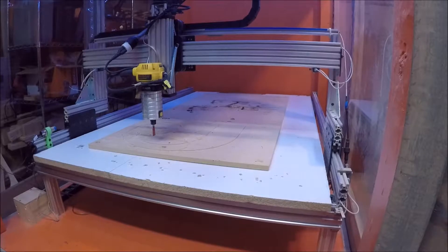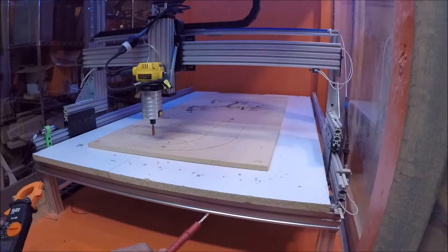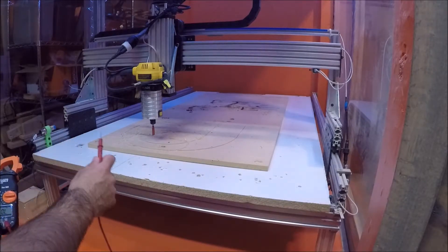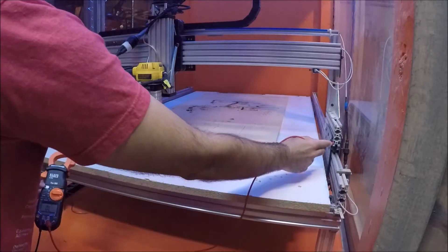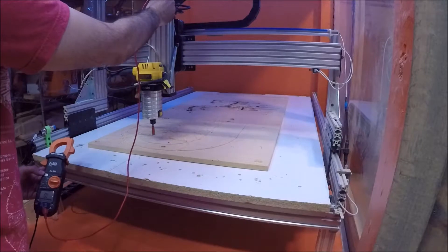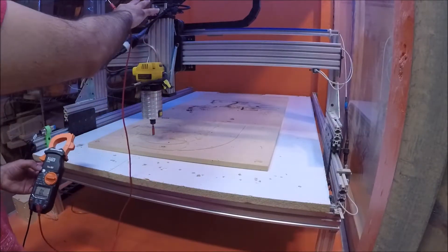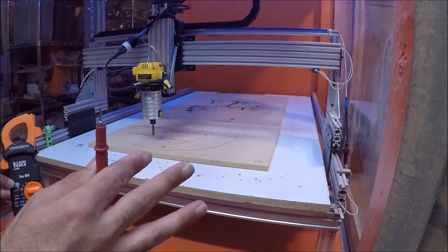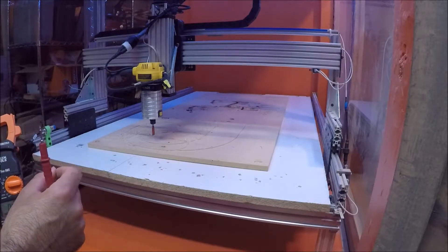I've installed all of my ground connections. Let's try doing that continuity test again. I've already attached one probe to the ground bus in my control panel — let's tap around and see if we hear any chimes. Yep, there we go — so the frame is working. The whole frame is now at the same potential. The gantry is at the same potential — both sides. The Z axis tests out perfectly. Even the springs are grounded. And it's robust enough to even ground the frame of the router itself. So everything — all the metal on this machine — is now connected to a single point that is connected to ground. Hopefully that helps reduce the EMF problems we're having.